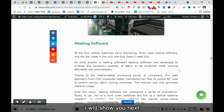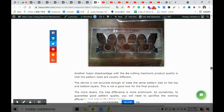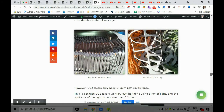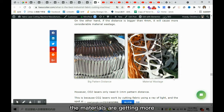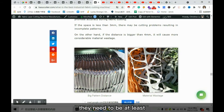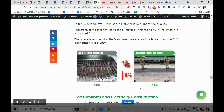You can see this cut by the die cutting machine — it needs space in between, which is a huge waste of materials, especially since materials are getting more and more expensive. For die cutting, spacing needs to be at least 4mm, while laser can be 0mm. The comparison saves at least 8%, so for a whole year you can save much more material if you use laser. That's one of the key factors why factories abandon die cutting machines.